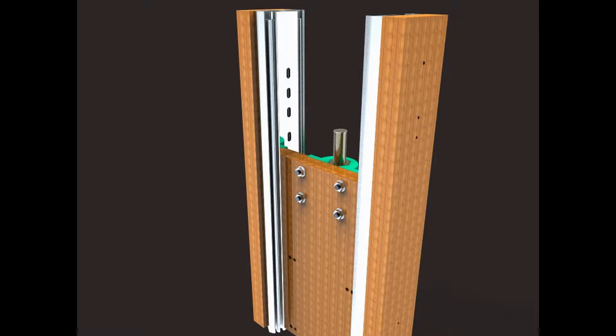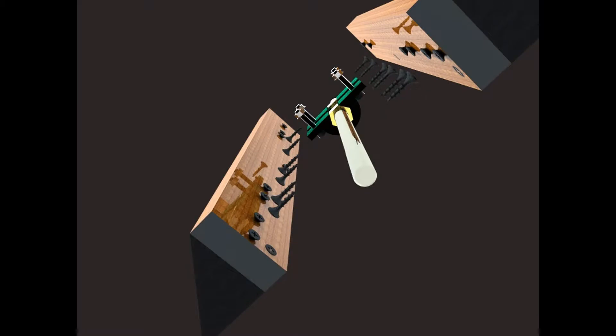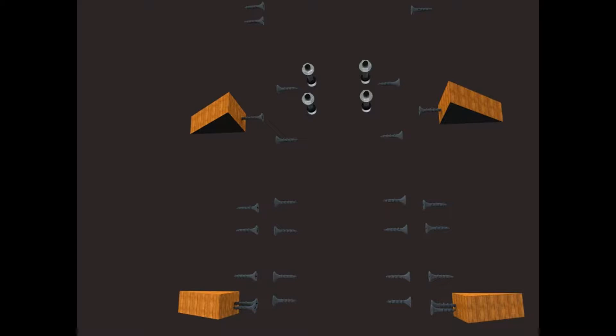From this you can see our finished assembly. I'm going to strip away the back panel so that you can see how the actual hardware attaches more directly — all the individual hardware. It is important to understand how the hardware comes together to completely encase our unit. Failure to put all of the hardware in the correct locations will cause it to bow, bind, or vibrate. This will throw your eventual cut pieces out of spec. The tighter the tolerances here, the tighter tolerances you'll have on your finished part.